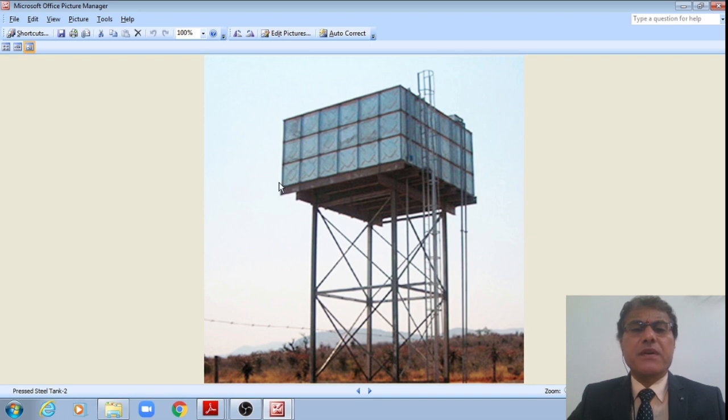The plates are of standard size 1.25 by 1.25 meter as we have discussed in the previous lecture, right? This is how a three tier pressed steel water tank of height 3.75 meter, and here we do have in length direction 6 plates as well as in the width direction 6 more plates, right? Therefore 6 multiplied by 1.25, it is now 7.5 by 7.5 meter